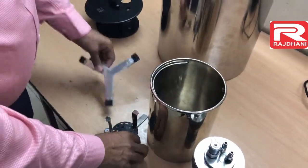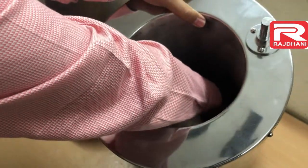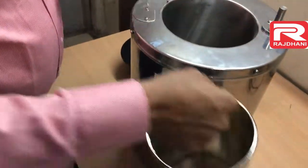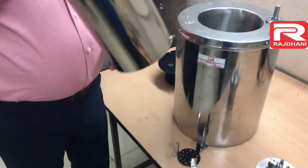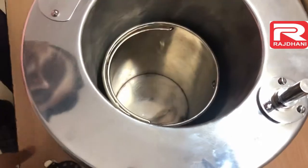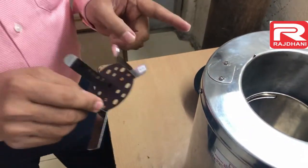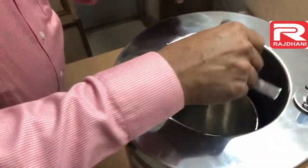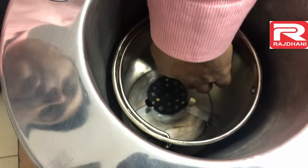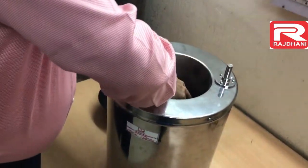Now what I will do is first put the calorimeter vessel support inside the outer jacket — there is a welded strip — and fix it within that welded strip with leg number one. Then I will keep this calorimeter vessel, placing this notch into the groove of the support. Now you can see it is fixed. Now I will place the bomb stand. Here also there is sticker number two, and where the strip will come, just against that position, there is also sticker number two written on the inside surface of the calorimeter vessel. Now we will keep our bomb.